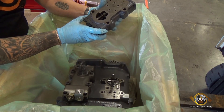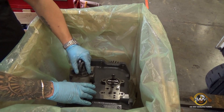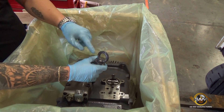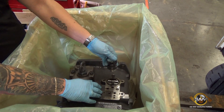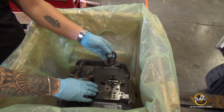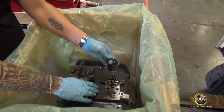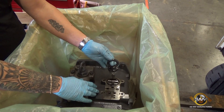You can see where both of these spool valves have a recessed position where the leg of the swash plate or horseshoe must lay inside. If it does not, your regulator will not function. With our cap taken off the old regulator, we're going to put it back onto the new regulator. These two pieces are anchor points — they are separating pieces in two different units, so you can leave them on or take them off. We suggest leaving them on in case you need service in the future.